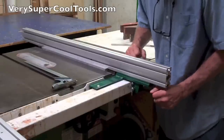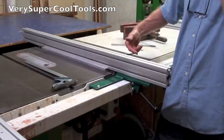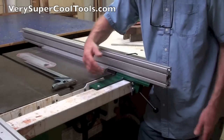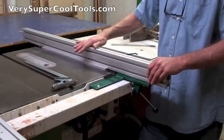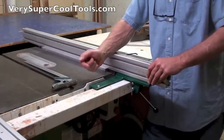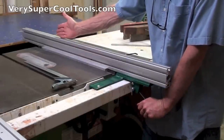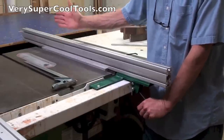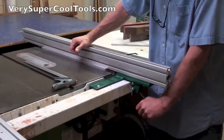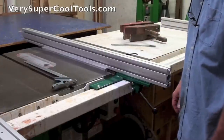If you did want to, if you felt you were ever so slightly off, you could release the tension on the set screw on the inside or tighten the other one to kick the whole unit a different direction. Once you have it very close you can still use the set screws that press the spring steel for final micro adjustment to really dial it in. Some people like to have the saw canted out slightly — I've never done that. I always just try to get the saw running as absolutely parallel as possible. That looks pretty perfect to me.